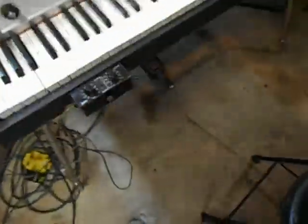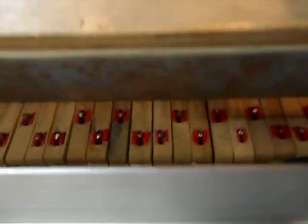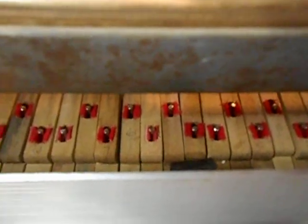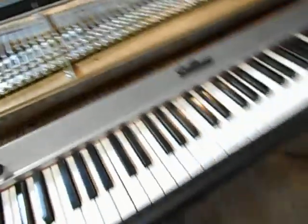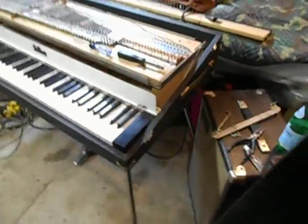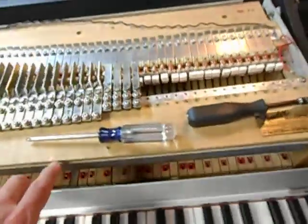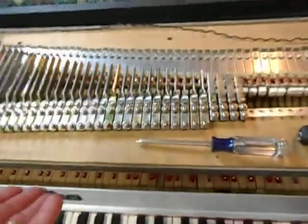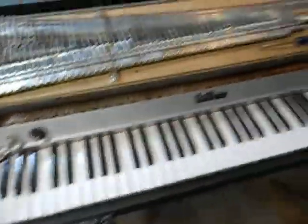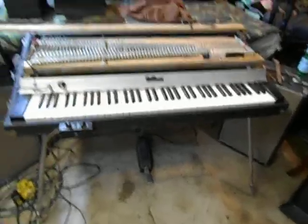Oh, and the key bushings have been fixed. So these have been replaced by steaming off that top piece of wood and using a caul to glue in these new pieces of felt, and then use hide glue to put them back together. So for the first time now, Mr. 1972, cleaned up a bit, is finally taking shape. I also cleaned a lot of corrosion off of the metal part of the harp whenever it was lifted up. There was tremendous corrosion, like there is here, right in here. This is really dirty. But nice progress, and it's sounding pretty musical. Grooveness. But that's the 72.